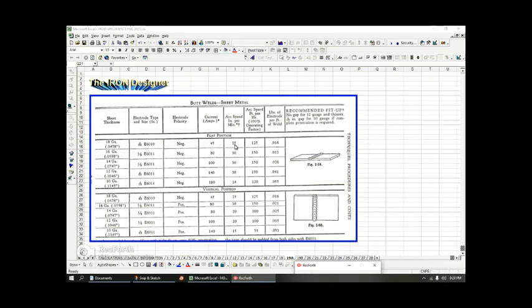The arc speed in inches per minute is again flying. They're getting up to 30 inches per minute. And the arc speed in feet per hour at 100% operating factor. So these guys can really fly pretty fast. And the important part here is look at their pounds of electrode per foot of weld.